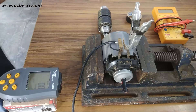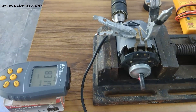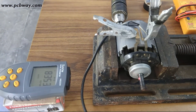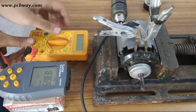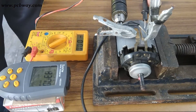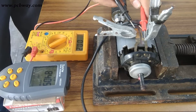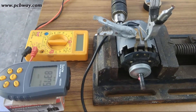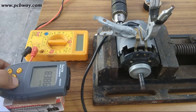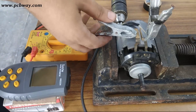As you can see, the RPM reflected on the tachometer screen is 8350 and it keeps fluctuating, but it is somewhere around 8000. Now let's measure the exact input voltage to this motor after the supply has been connected, since there will be some voltage drop due to load. For an RPM of 8350, the input supply is 19.5V DC. This is also applicable when the motor is used as a generator — when the RPM is around 8350, the generated voltage will be 19.5V DC.